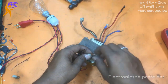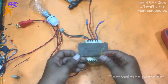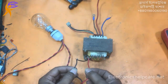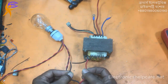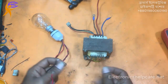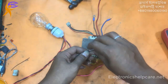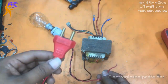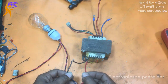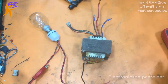First we are going to check the primary. Here there are 4 wires; we have to take 2. For this case we have to check which 2 are secondary — which one is low light and which one has no light. The no-light ones are the 2 we can use. The black one is the common — the black one is the neutral — and I am going to check the phase. This one has 110 volt, this one may be 180. This yellow has no light, this yellow also no light, and orange also no light.